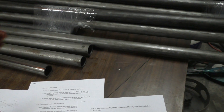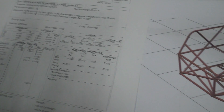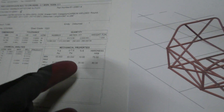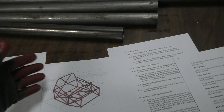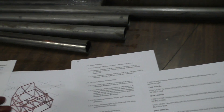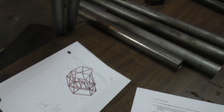There's one more thing you need to know: the grade of steel in your tubes. Whenever you get your tubes, make sure to get a spec sheet along with them. The spec sheet tells you the tensile strength, what materials go into making the steel, and the elasticity — how much it can stretch before it breaks. That's really important for calculating how strong your final design will be, especially for parts not mandated by regulations.